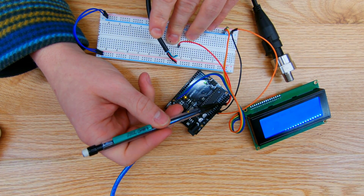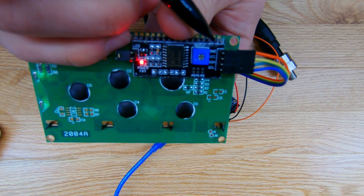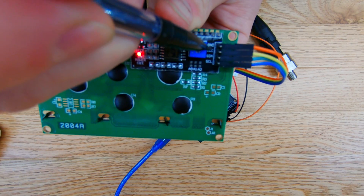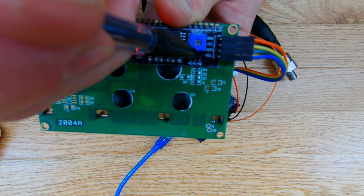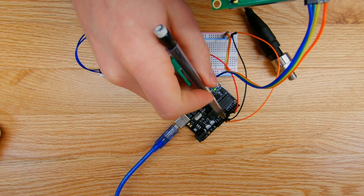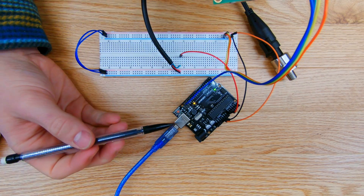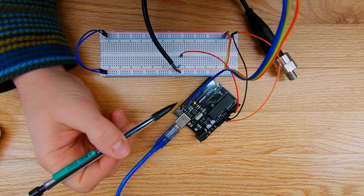In this case I'm running that green wire to analog pin A0 on the Arduino. For the LCD screen: ground pin to ground, VCC to 5V, SDA to the SDA pin, and SCL to the SCL pin on the Arduino. The ground and 5V are on one side, and the SCL and SDA pins are labeled on the other side of your Arduino.